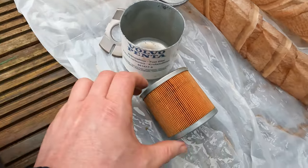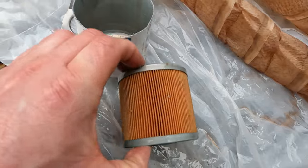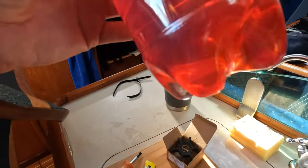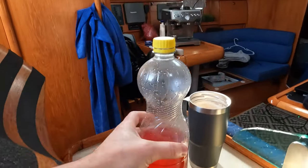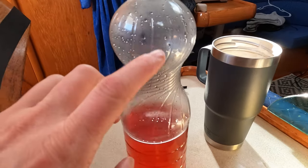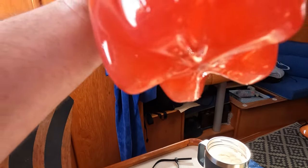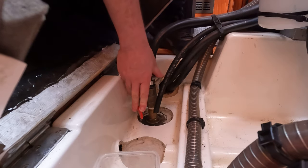The bottom of the bowl — there's a much better quality cartridge. Next up we're going to do the impeller as part of the water side of cooling. Here from the filters you can see a little bit of water at the bottom there. My last video was a fuel polishing video where I talk about diesel bug. You can just imagine that this is condensation inside your fuel tank — the drops go down and settle at the bottom, and sooner or later it all mixes together as you're jogging along and then your fuel doesn't burn. I'm just going to close the seacock here so that water can't come inside the boat through the raw water impeller intake.